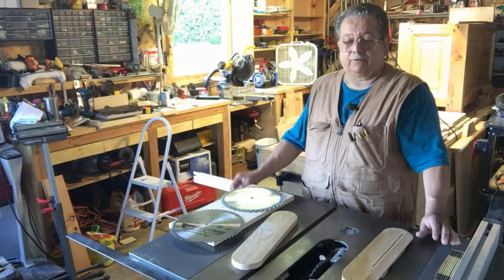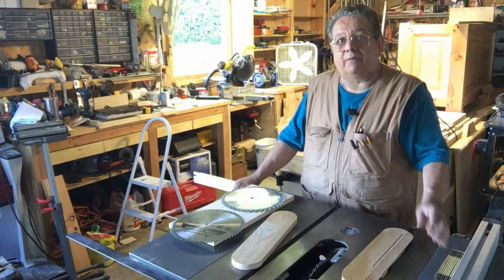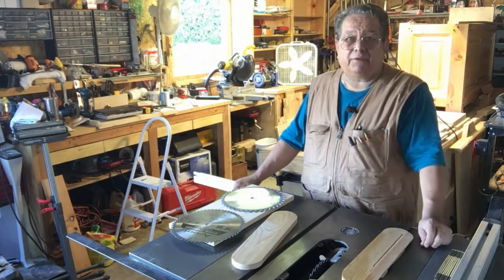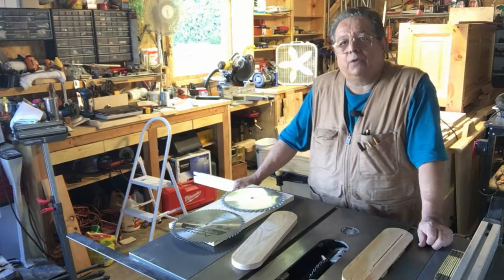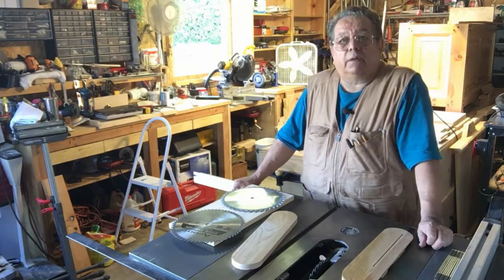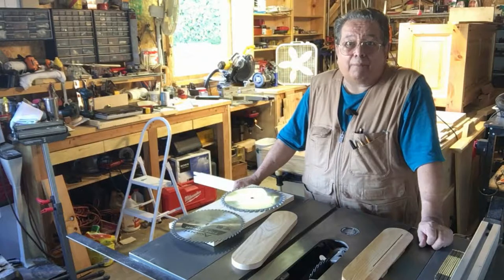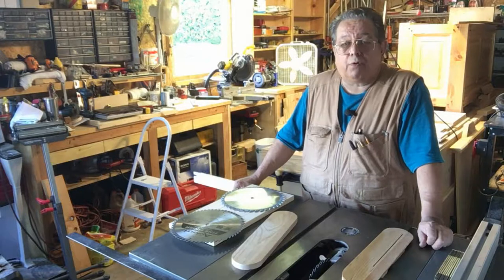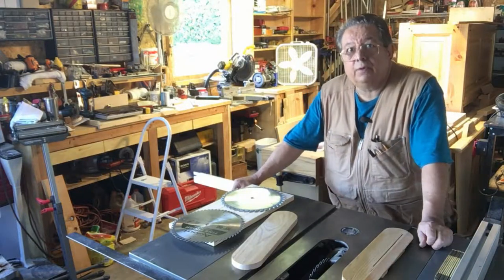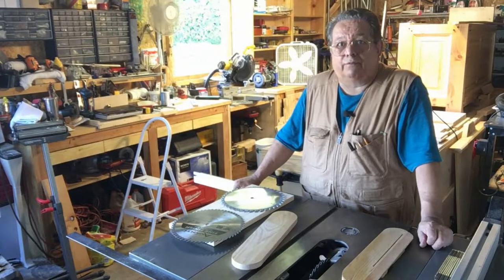So for box joints, I'm not going to put any pictures here. Just the next photo, I'm going to have them all done. I go with a half inch. I either go quarter or half inch, 3/8 sometimes, but mainly it's a half inch I'm working with, because for me it's better. This idea of 3/8 working pretty good only works with certain numbers. Mathematics, work it out yourself. I'm dealing with 18-inch deep drawers, 6-inch deep drawers, 6.5-inch deep drawers. So 3/8 is not working for me.